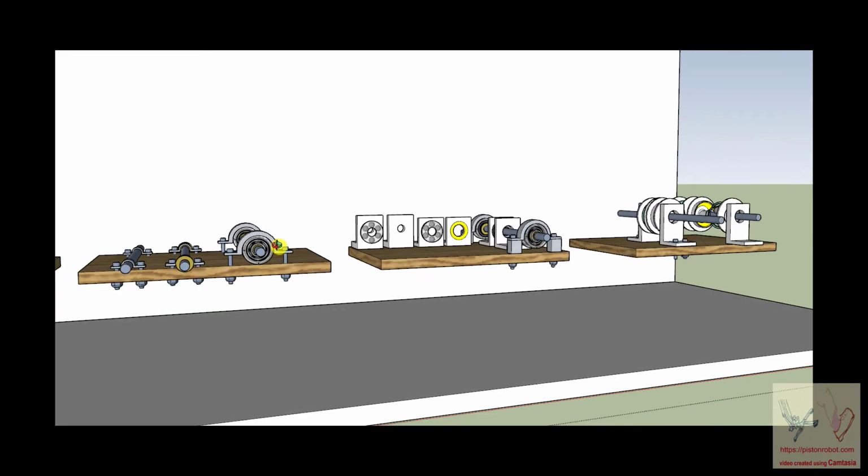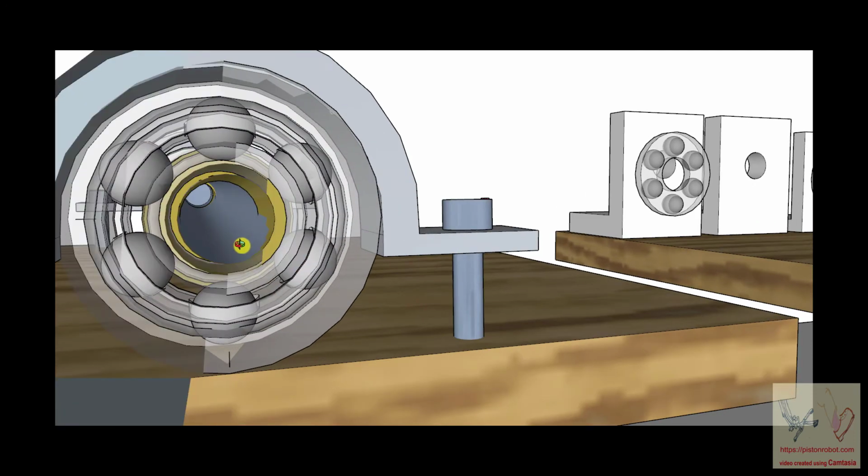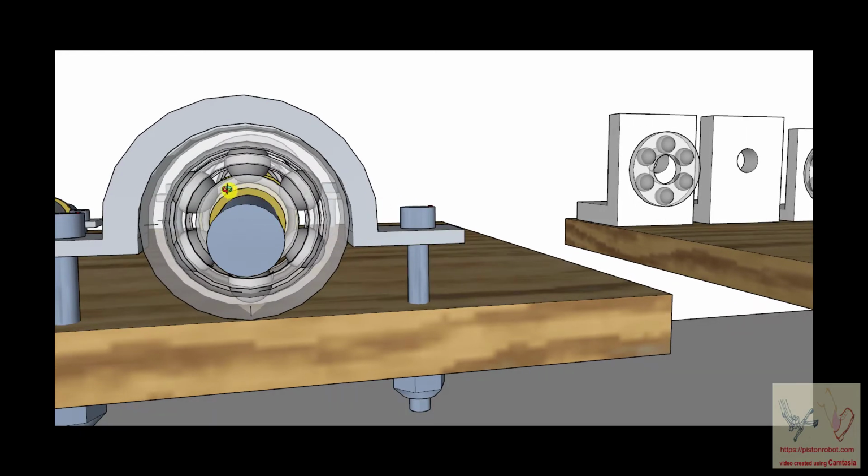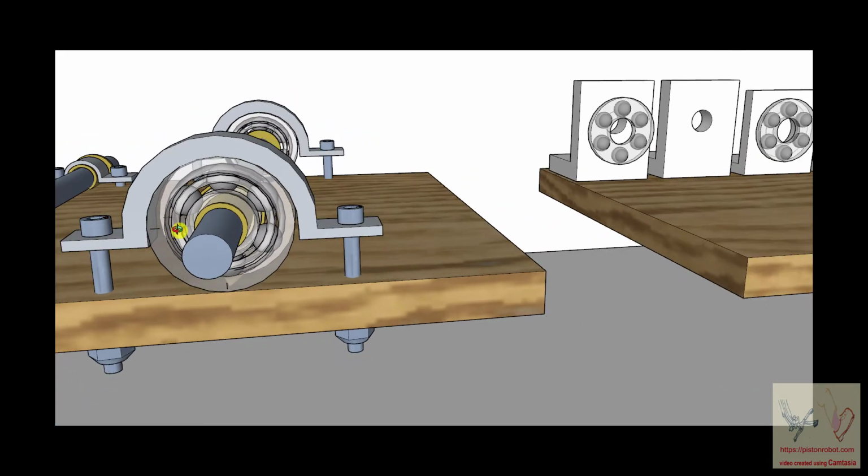And the final thing, and this is where bearings get really weird. If you move this shaft, here's the center of the shaft. That's a radius of this shaft. And motion of the shaft along its radius is called radial motion. Remember that bearings have been around for 200 years. All these words were created a long time ago. I didn't make these words. So this is a radial motion of the shaft, and this is a radial stabilization of the shaft. It's prevented from moving in its radius.